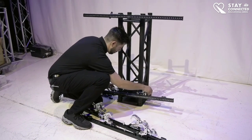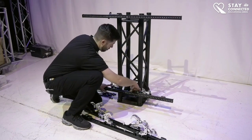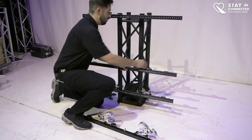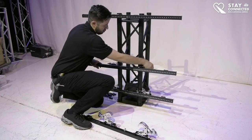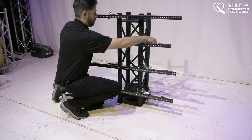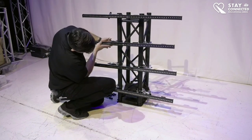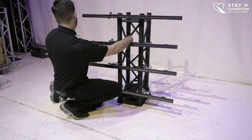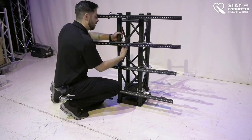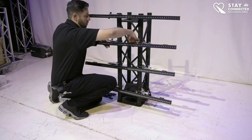Obviously, some of you dealing with larger scale truss on bigger productions are looking at this like, well, I don't have that little small 12-inch truss. We're on something much bigger than that. Can we widen these out? And you can. The furthest that you can go is up until you hit the output and input sockets on the actual frame of the unit. The units themselves also have an eye hook mount into the frame, so you can actually safety cable each unit independently, so they don't have to be grouped together.